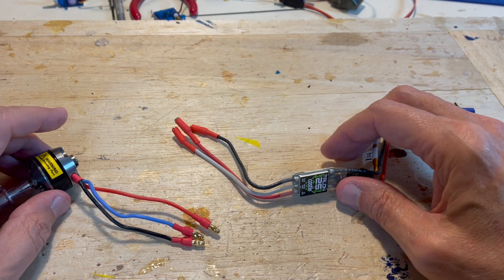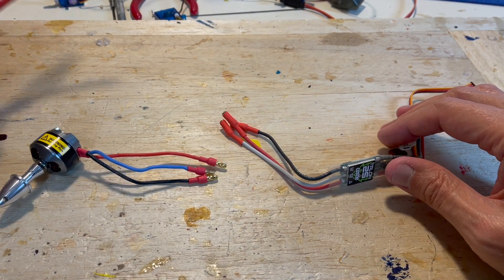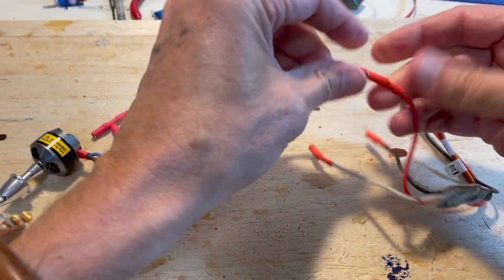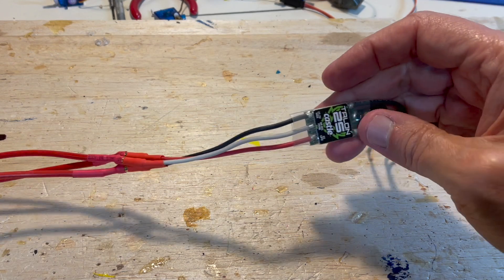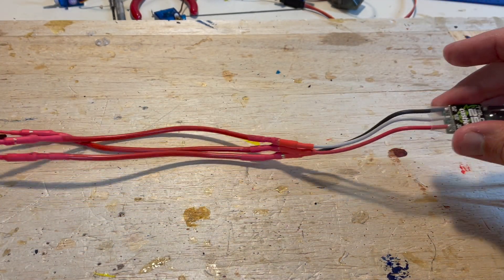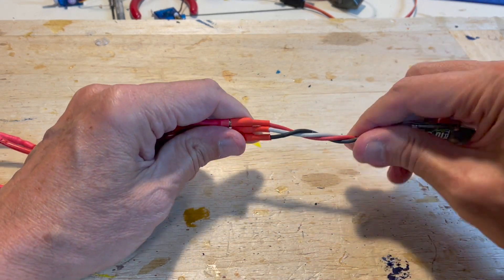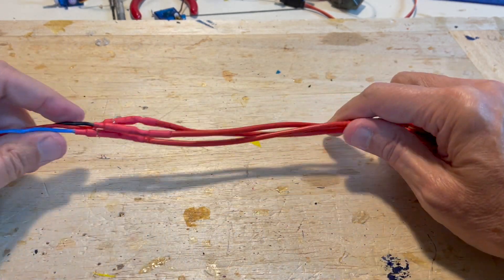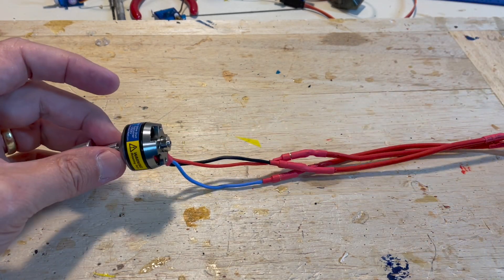In this example, I want to show you how to minimize interference if you do extend the wires to the motor. Here is the original setup — I want to make it longer, so I made these three extension wires and I'll plug those in now. Here is the extension through those wires. There could be a little bit of interference as current runs through them. The way to fix that is very simple: you twist the wires like this, about three twists per inch the entire length, and put some tape to hold it in place. That will mitigate any interference effects from the extension.